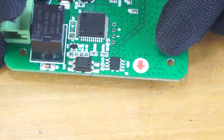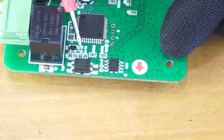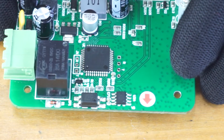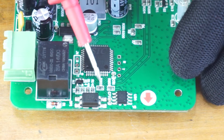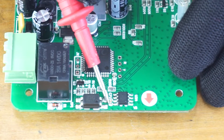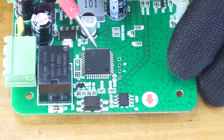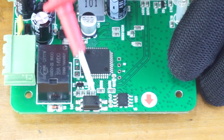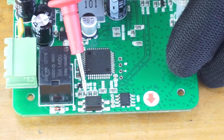Now let's talk about the switching circuit. This is the optocoupler, being used to isolate the microcontroller from the switching circuit. The 28th pin of this microcontroller is connected to this pin of the optocoupler. This pin is directly connected to 3.3 volts. When the logic of the 28th pin of this microcontroller is low, the 3.3 volt turns the optocoupler on, which means current will flow through the optocoupler transistor side.